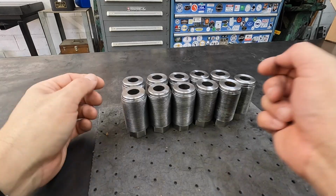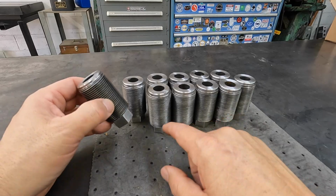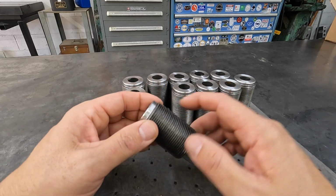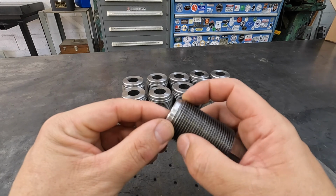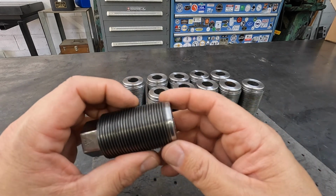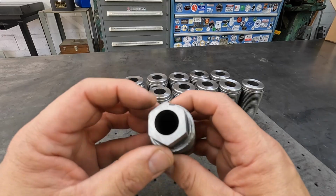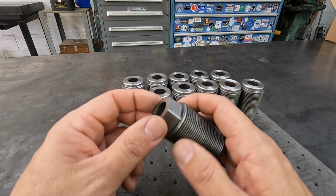We've got all of our adjustment bolts cleaned up now. There are a couple that I'm going to go through and check the threads. There was one that's got some damaged threads on it, like that guy right there, but I don't think that one's an issue. Anyway, we got the face cleaned up on all of them now. We turned that OD just to make them all even, and hit the top on the grinder where it was rolling the hex over from all the years of adjustment.